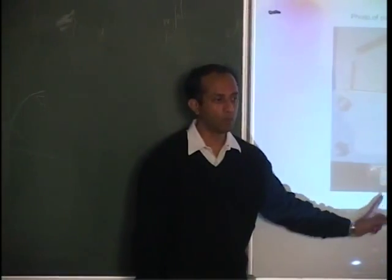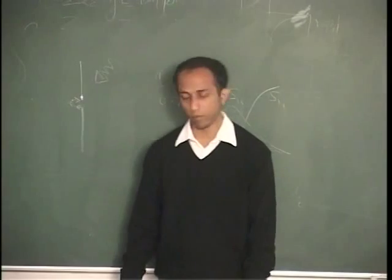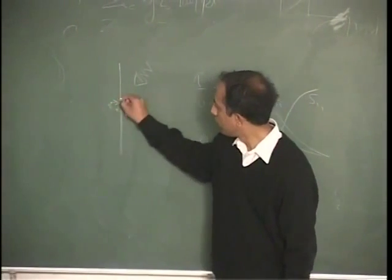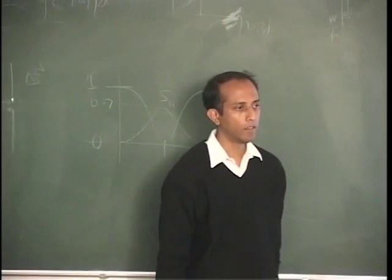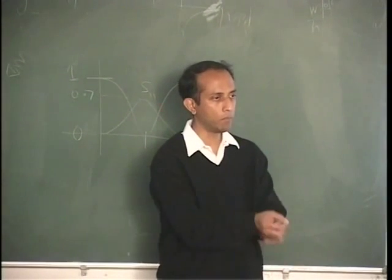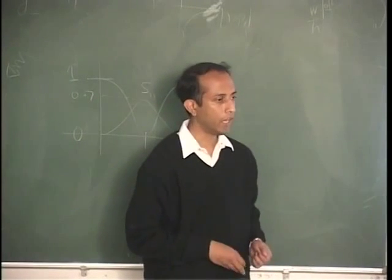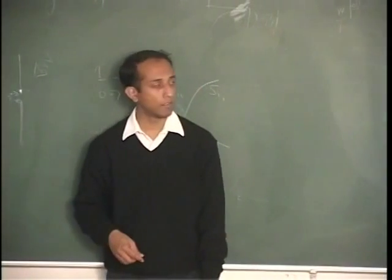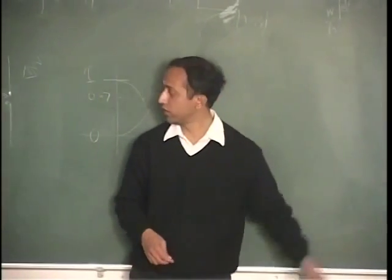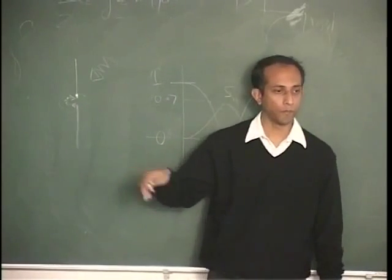It's a coaxial input. And you will study all about dipole antennas, but nobody will address this one. What is there and what does it behave like? Okay. At low frequencies, you simply connect the wires and maybe screw them there. At high frequencies, what does it really behave as? At high frequencies, for example, this one is at 3 gigahertz. This will be more important than the rest of it, actually.